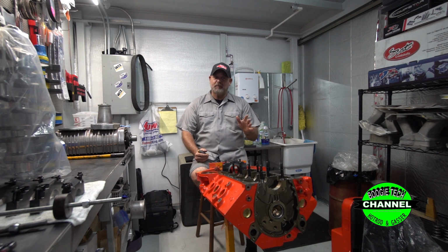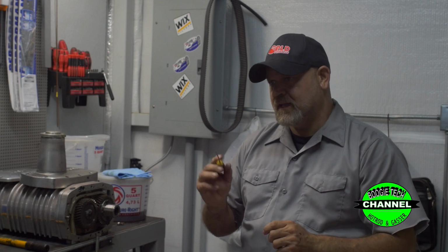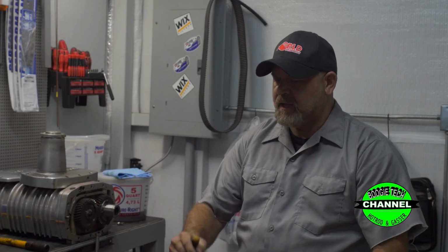They ought to be paying a little bit more attention, but it really ain't the engine builder. It's the crappy pans you're getting now, and I don't care if it's a $250 pan or an $84 eBay pan. Actually, some of the $84 eBay pans fit better over this. So I'm going to show you how bad these pans fit over the rear main seal and show you need to dolly them out to get them to do right, because it ain't your rear main seal leaking.